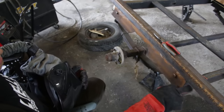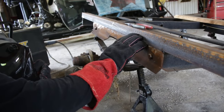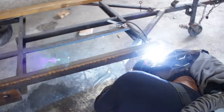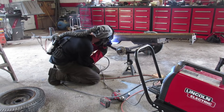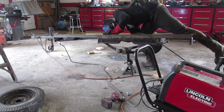When we stick our quarter-inch bolt in to bolt the 2x6 to our frame, we'll be able to pull it nicely right back tight. We have a tack in place — pull our blocks out so we don't catch any fires. You don't need to weld it completely solid. This is already solid enough because it's C-channel. We want to carry the weight over to the front because our trailer is pretty flimsy in the front, so we'll lift up on this a little bit, catch this angle, weld it nice and solid on the front, then stitch it on here and weld it solid at the back. Along with our 2x6 bolted to the top, we'll have a nice sturdy trailer.